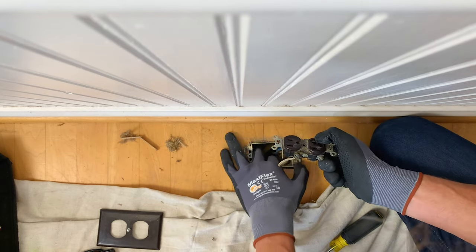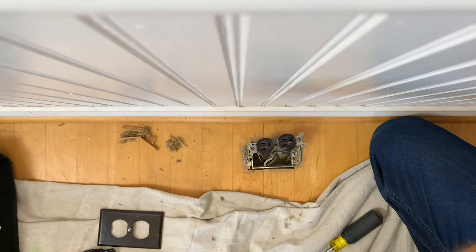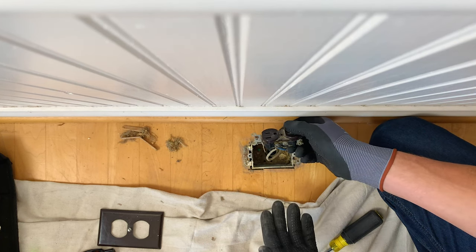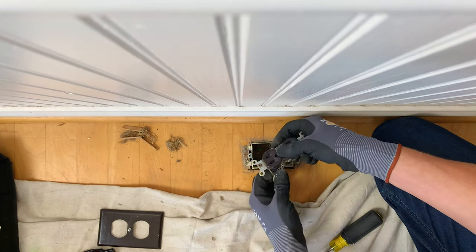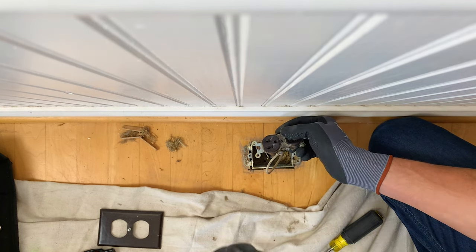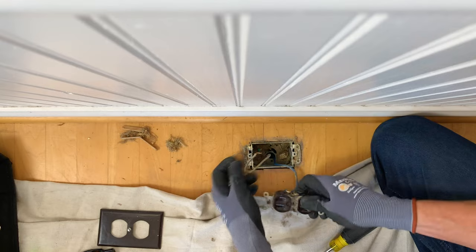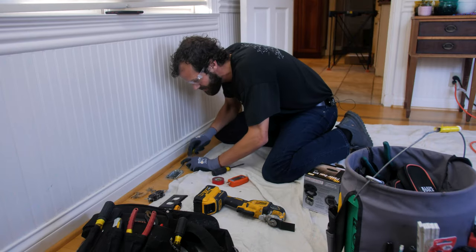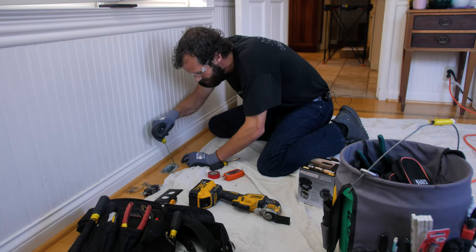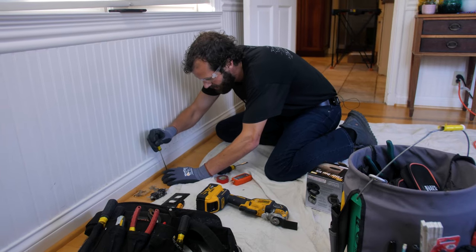These are combustible materials. Part of the reason a floor assembly is required is because this is a gasketed sealed assembly with a good tight fit. And what's going on here, existing, is not that. So the box has become a flammable environment with kindling for the fire if anything goes wrong. Really not a good situation. I'm really not concerned about the state of the box. If it comes apart on its way out, that's completely fine. I just want to preserve the floor, which is why I've got this drop cloth out here. Put my power tools on it.